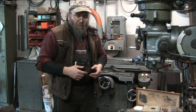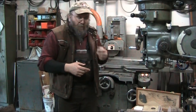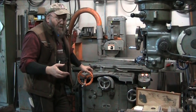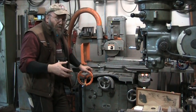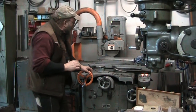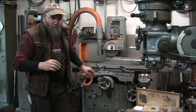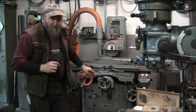Now, I picked this up. This is one of the first pieces of steel that I played around with when I first bought the mill, and milled it all four sides. And while it is precise, I stuck the micrometer on it and saw there's a little bit of a disparity over one corner. So I decided to go ahead and just grind one side perfectly flat. And you can't see it from where you're at, but this corner over here is still skipping. So we're going to go ahead and make sure that it's nice and parallel across the entire face.